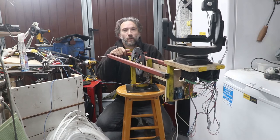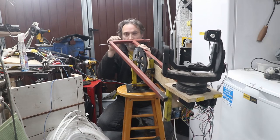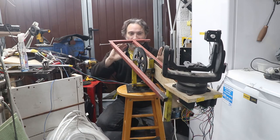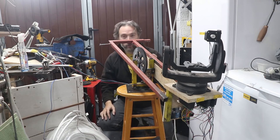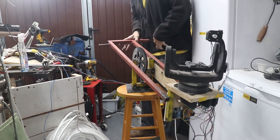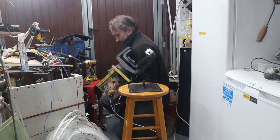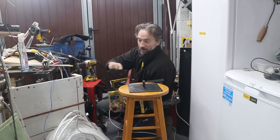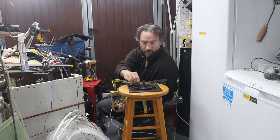This is definitely one of those operations where you need to be quite careful with your fingers, because when it's off of its stand the whole scissor actually wants to collapse on you. When you're picking it up suddenly, the forces involved can be a bit weird — which is why I have the block of wood to keep it stable. It is at this point that I realise I don't think I have an Allen key to hand to put these in.